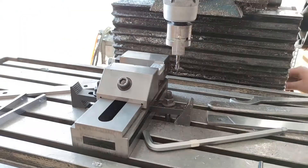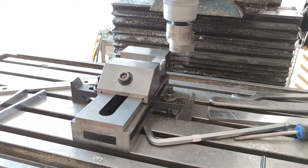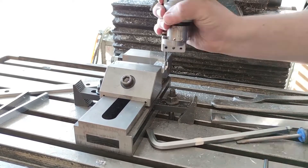The last thing was to machine the radius for the proper fit to the spindle. I did that with the boring head but had to use an old carbide 6mm end mill because I could not find the shorter boring bar.